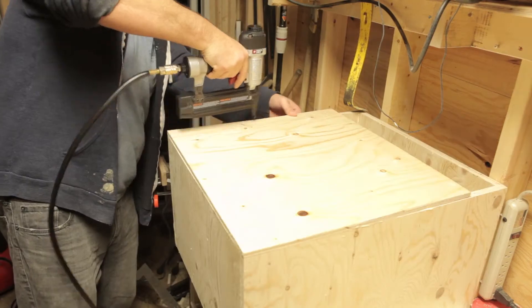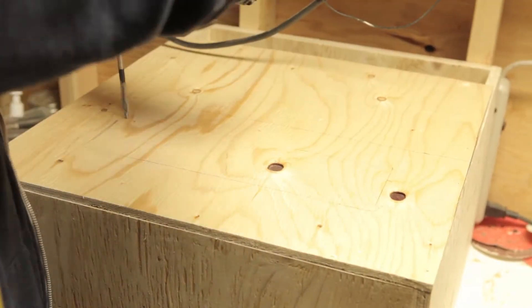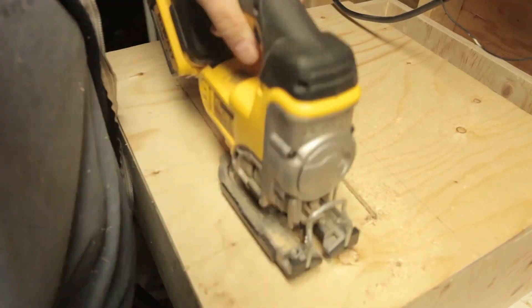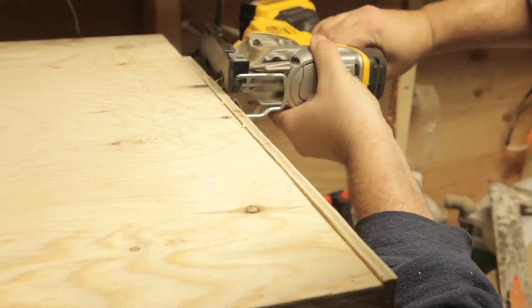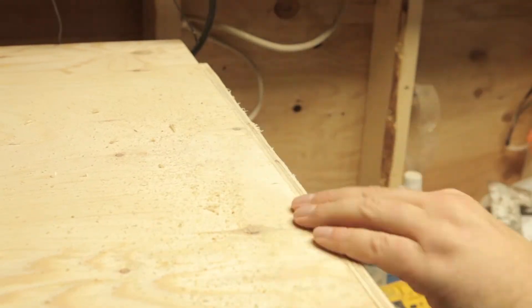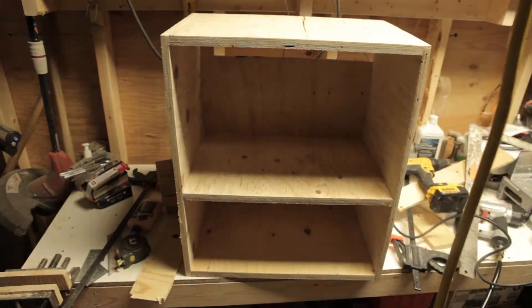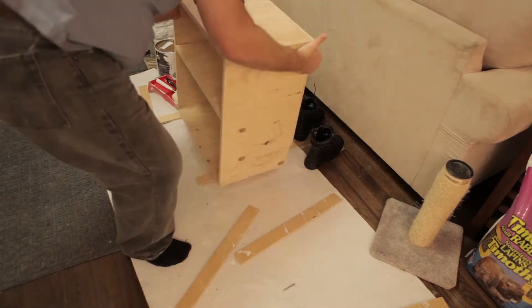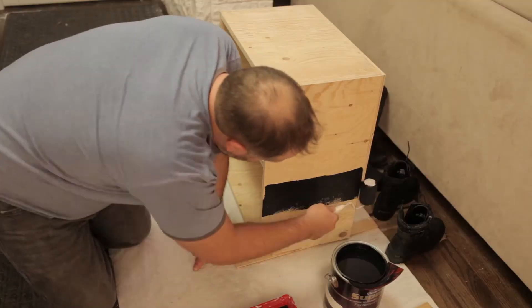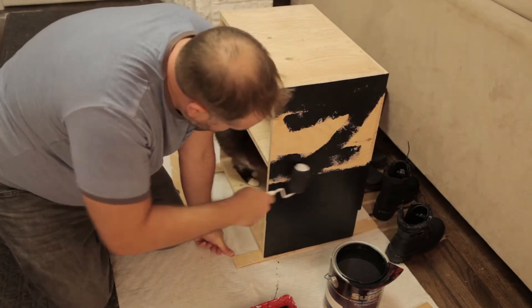I marked a space on the back for the cables to go through and used a drill and a jigsaw to cut it out. The edge of the plywood on the back wasn't square to the frame, which means one of my cuts wasn't straight. I just took a jigsaw and shaved off the edge, then hit that with a sander to clean it up so there'd be no rough edges and it would look fine. I brought it inside for painting and let it sit for about an hour to make sure the glue had a chance to dry, though mostly the nails are going to keep it from moving.